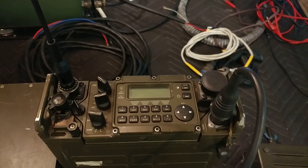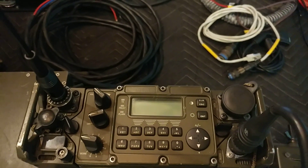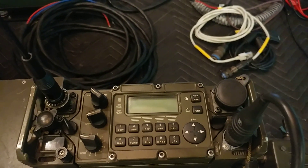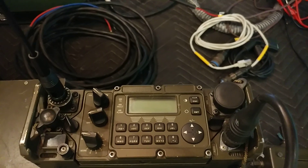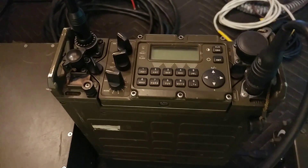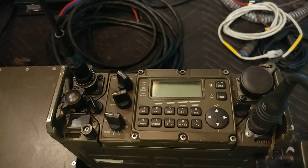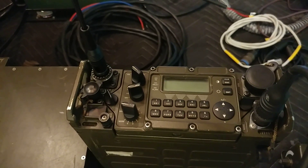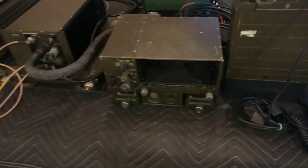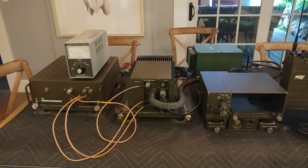Quite an amazing feat. However, there's no free lunch here. As a man pack configuration, this will work up to — I believe it is 108 megahertz. The HF portion of the band will operate up to 20 watts with a battery sitting at the bottom of it. The VHF portion from 30 to 108 will operate at 10 watts. However, above 108 — from 108 to 512 — it's only one milliwatt. That exciter mode is designed to be used in a vehicular setup.